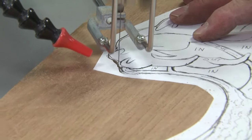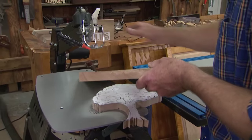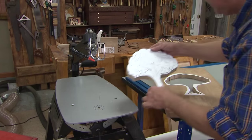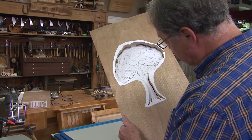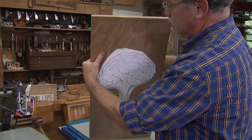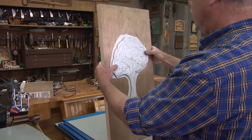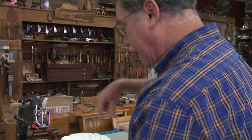Now we're all the way back around to where we started. Turn it off, let that come to a stop, raise this up — and that comes out. The blade is still going despite being a bit bent — that's what better steel does for you. Moment of truth: pop this in from the back, compress it forward, and it locks in — taps right out. As we make these other internal cuts, that will shrink the pattern down even more. You can see how it locks on the back side.